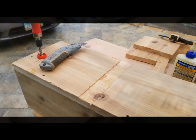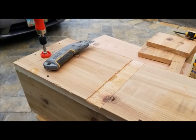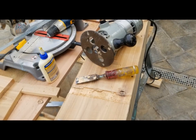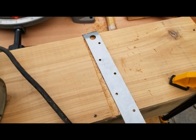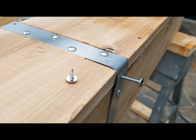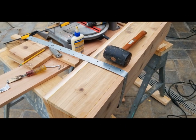I decided I needed to recess these straps because that top molding piece — if you didn't recess it, it would stick out and you'd have a problem. So I'm going to recess these steel bands using a router to make a small groove or mortise, then clean it with a chisel and a utility knife. These little half-inch screws with large heads — from a distance they look like rivets, kind of like an old-timey, medieval-looking construction.